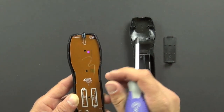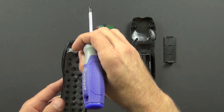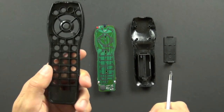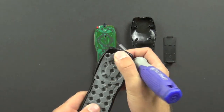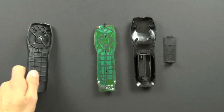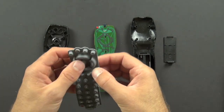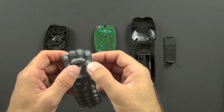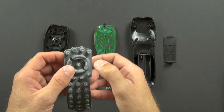There's also a little indicator LED here. Let's turn it over — we have our printed circuit board and our buttons. Injection molding is very precise, so you can get a really nice clean fit, and these buttons fit nicely into there. These buttons are a great way to reduce cost too, because there are no springs to cause the buttons to return. It's actually the material itself — a material called Santoprene — that has a particular resilience and causes the button to return to its original position after being pressed.